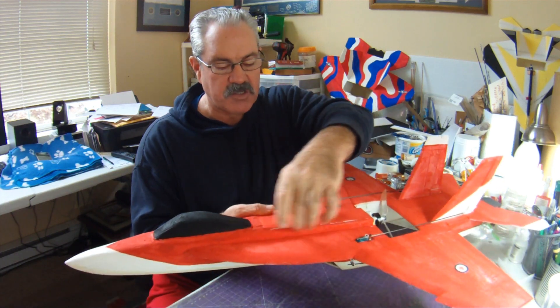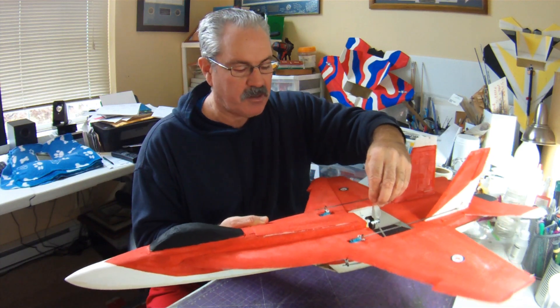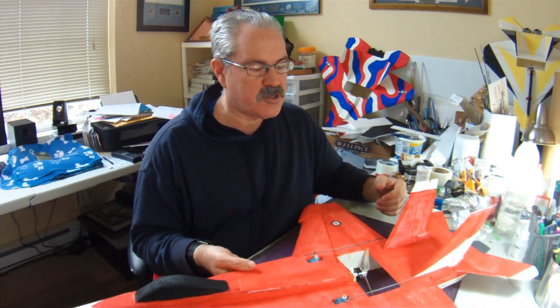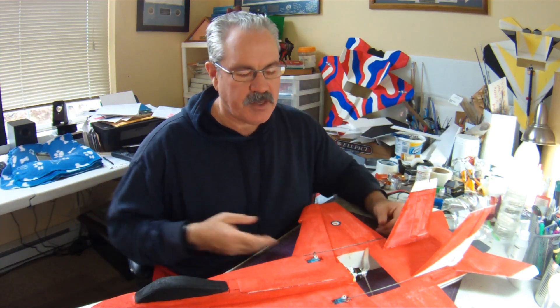It might be a compromise — if it's a really low-profile plane, the prop slot might require you to make it a little bit bigger so that you can still fit the battery in, and vice versa. Because I've normally already built most of the planes I've downsized in full size before, what I normally do is take the tile plans — these sheets for the prop slot and these sheets for where the battery is going to go — print those off, do some measurements, and figure out: that's what I did with this plane. I know I can downsize by 15% and everything's still going to fit.